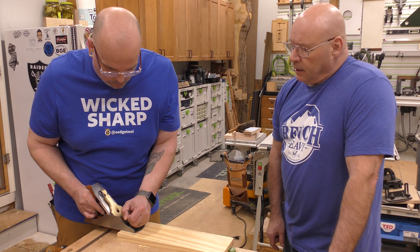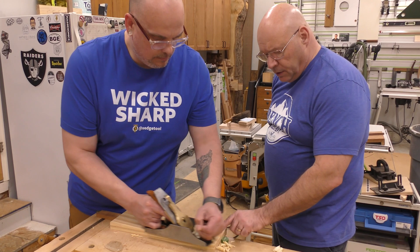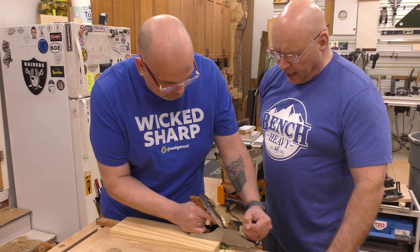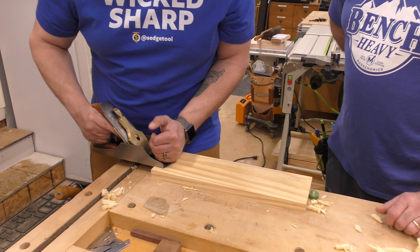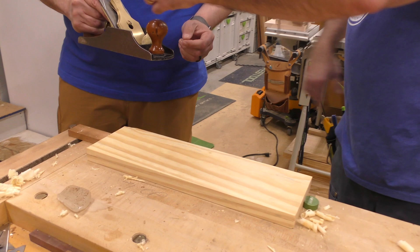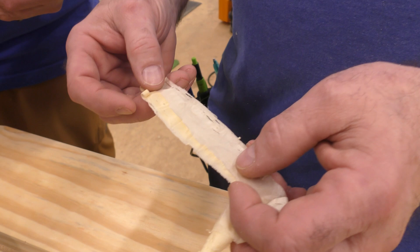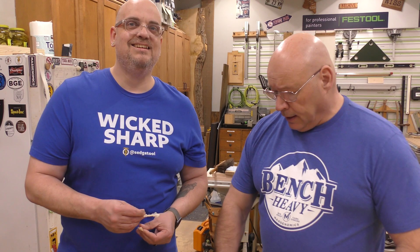Go back the other way — you'll notice the slop in there. Make sure you finish the cut. See how your weight dipped? You're not shifting that weight at the end to the back. Put a little more wax on there. You're getting it. Let's check progress — look how nice that is. You can go a little bit more, but then you stand the chance for tear out. In another video we'll go through grain direction like we did with the thickness planer. But I think that's a good start. As we always say: be positive, stay sharp.